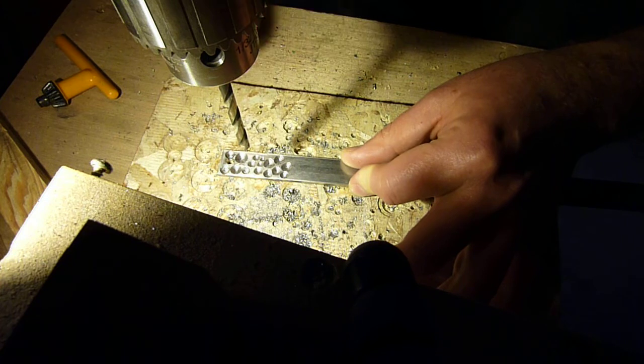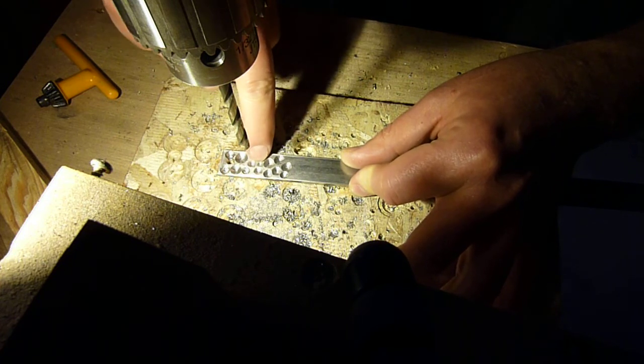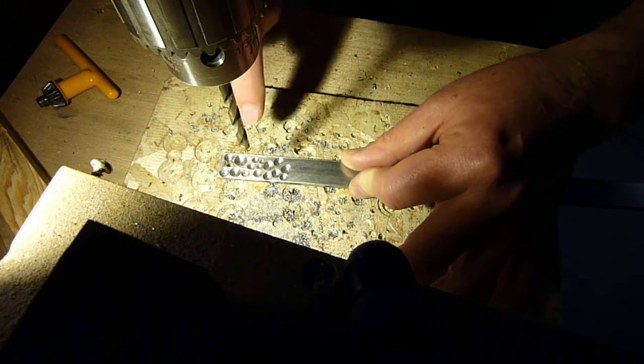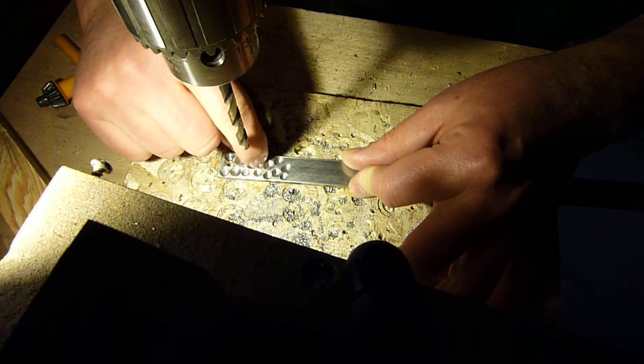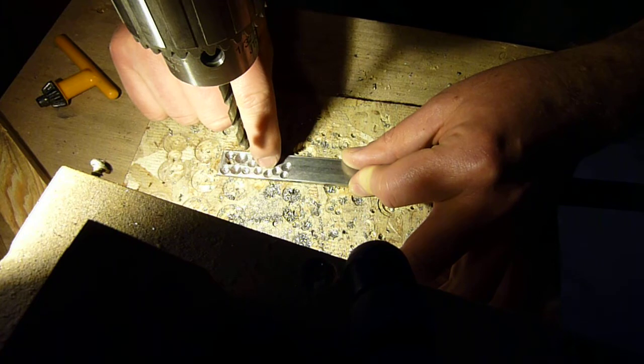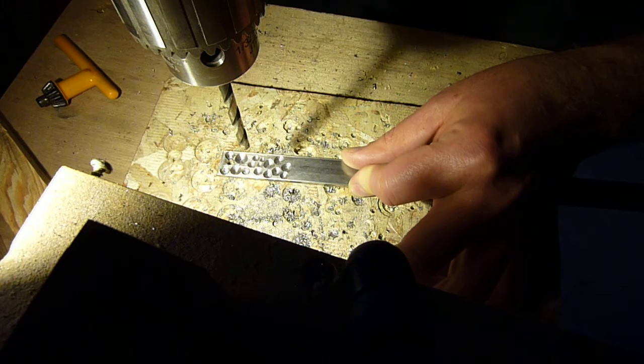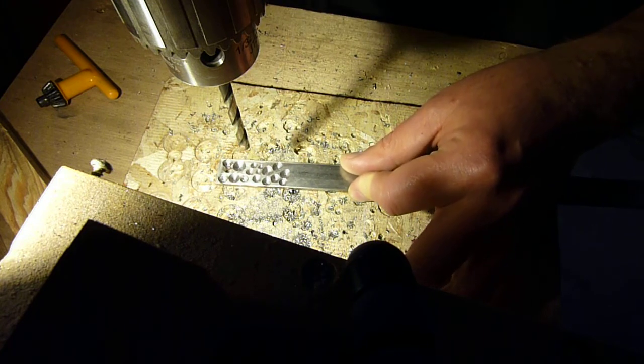And when I started to cut, it did not cut. I basically wallowed a hole in the metal with the bit, and it never actually cut anything. So it's got an edge on there, whereas a hole that cuts cleanly, there's no edge between the flat metal and the hole. There's like a little teeny tiny edge, but almost nothing at all. It's because the bit's actually removing material rather than shoving it out of the way.